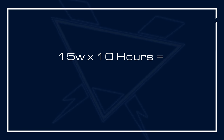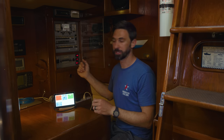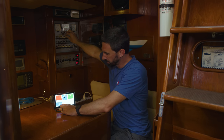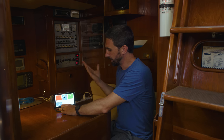So if I were to estimate over a 24-hour cycle how much the lights will draw out of my batteries, I have to assume a duration. Let's say I use the lights for 10 hours a day — 15 watts times 10 hours is 150 watt hours, or 0.15 kilowatt hours. I can go through each device and see how much it draws. My new baseline with the lights on is 29 watts. Let's see the water pump — if I turn that on, you're going to hear it running. I'm at about 85 watts, 100 watts, 120 watts. That draws about 70 watts or so for the water pump.